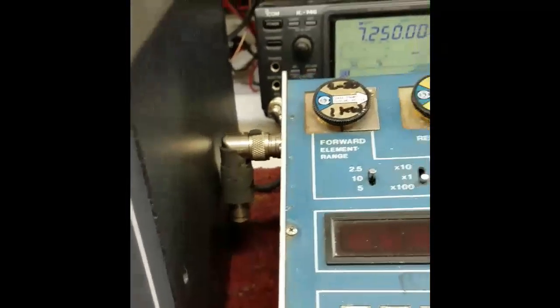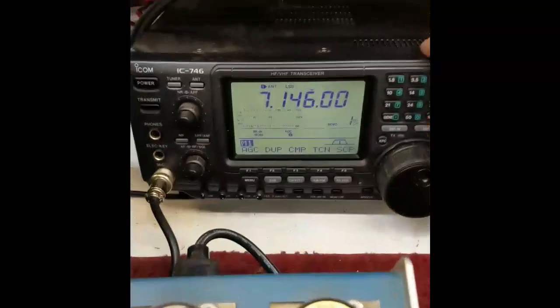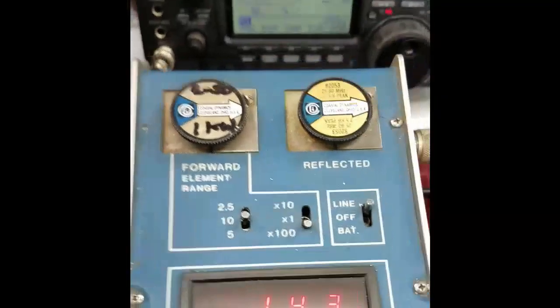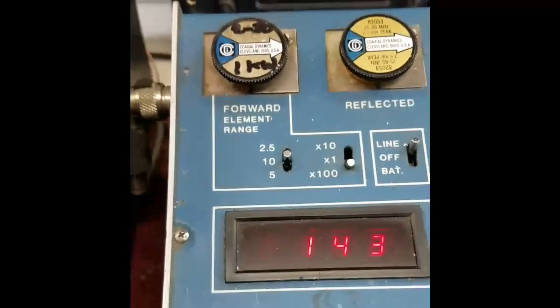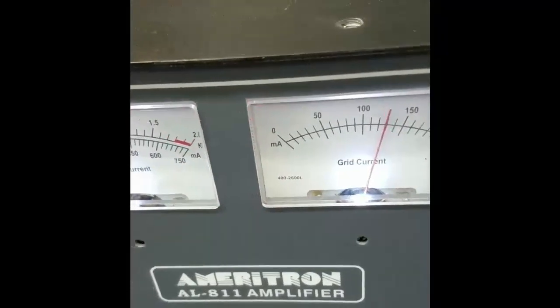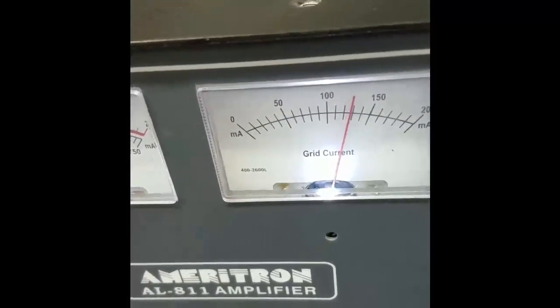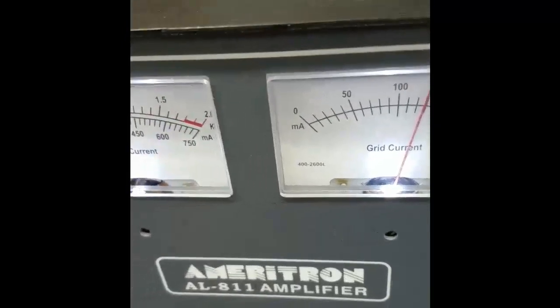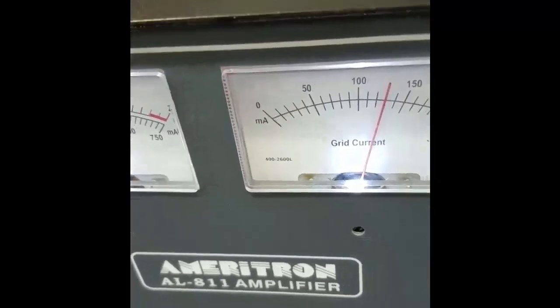What this is going to do is let me have more drive power into the amplifier. The amplifier is on standby. I'm going to go back to single sideband so I can run a tuning pulser. Tuning pulser is on — I'm back at about 140 to 145 watts peak envelope power for drive power. I'm getting a little red from the TOF, so we'll tune it back to be around 130 milliamps or so of grid current.